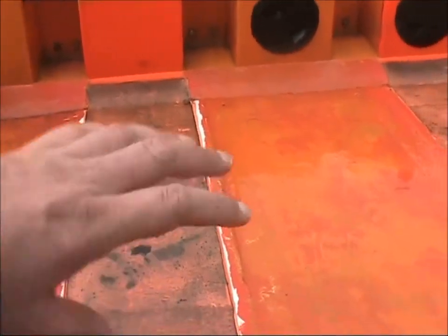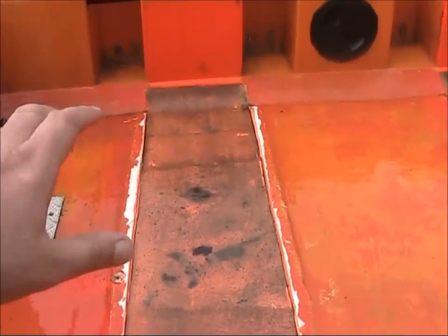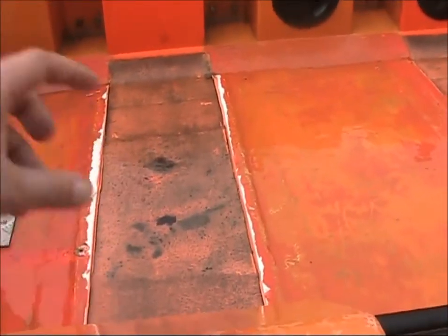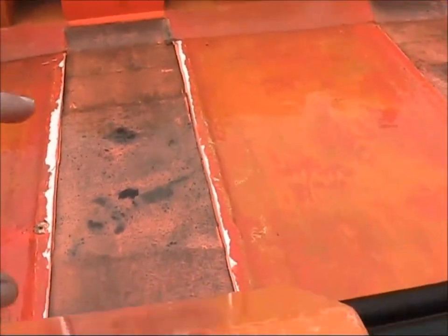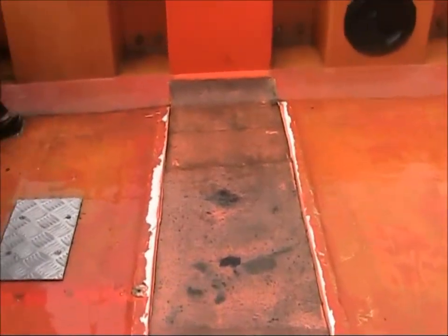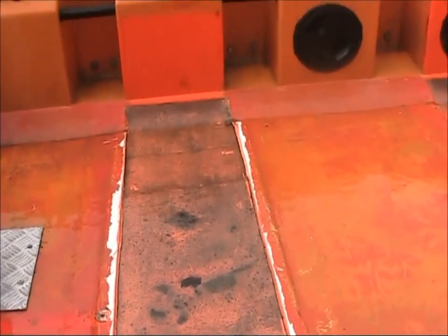What we've got to do now is make a seat for here. That will be made out of steel and powder coated. It will go here but it will be off the ground with feet so the water just washes underneath. It will also incorporate the fuel tank, the emergency paddles, and a few other bits and pieces - all nice and tidy and out of the way.